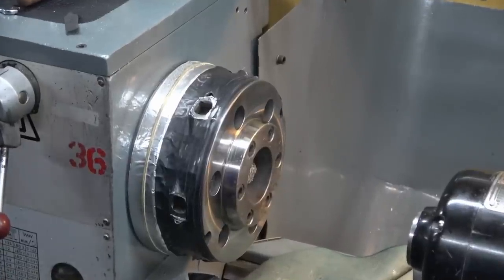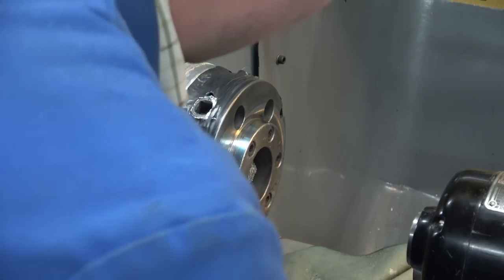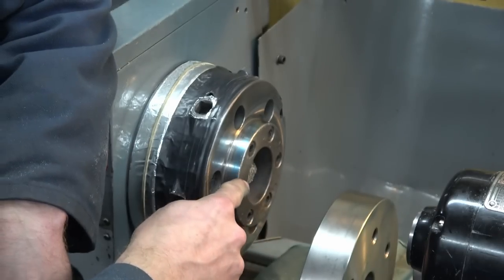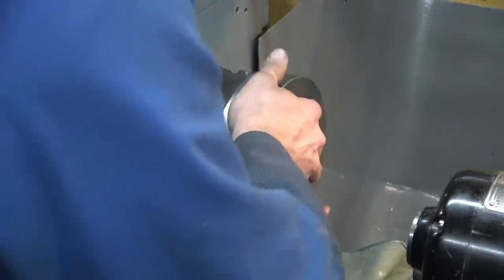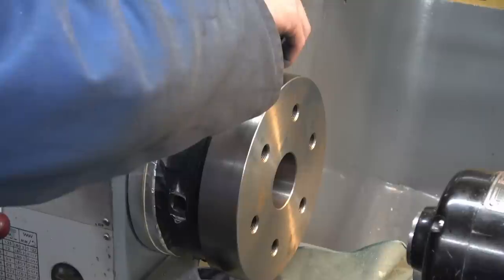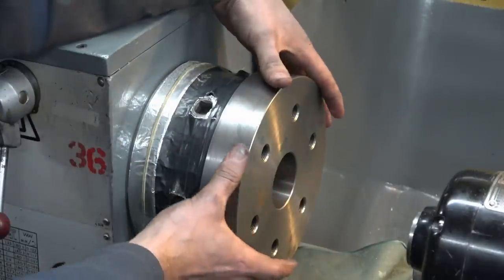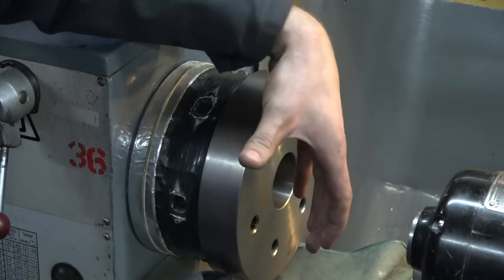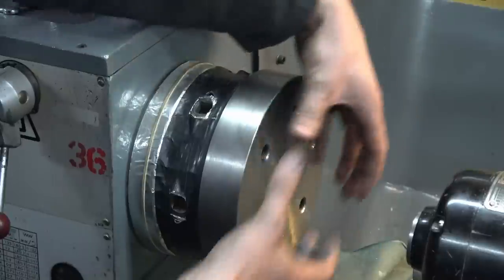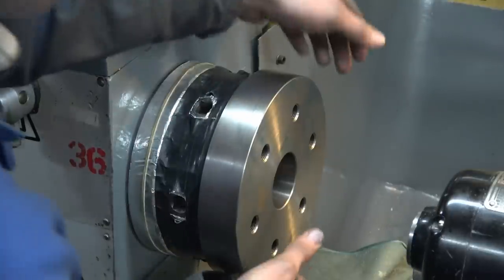Several hours have now passed since I last had the camera on, but I'm there, freshly blued up. If I now put this on it can be observed that the taper now has blue on it but the face doesn't. Taking a 1 thou feeler gauge I can come round this face and it just goes in all the way round. That means that when the draw bolts are done up it's going to pull those tapers onto each other firmly, making this a stable work-holding method — the radial portion because those tapers are tight against each other, and face to face it actually can't go anywhere either. I'm pleased with that and I'm going to go as far as to say that's been highly successful.